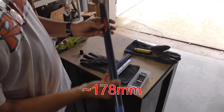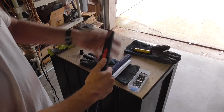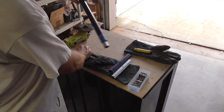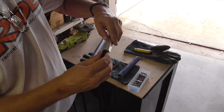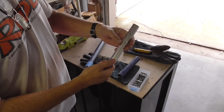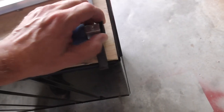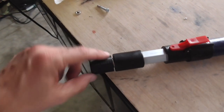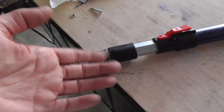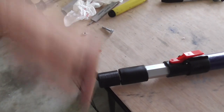I needed to make my handle a little bit shorter, so I cut off seven inches. I wanted it to stick out the normal amount, so I shoved it down and cut it off. That means I lost the little stopper that goes in the end, so I had to drill that out and push it out from the inside — kind of knocked it out with a drift. I put this on for support and banged it in exactly like in the original. This part on the end is 3D printed — it's a very tight fit but I want it that way. I'll force the handle on there, screw it all the way down, then rotate the handle to where it belongs and drive a screw through it.